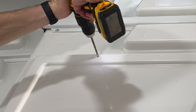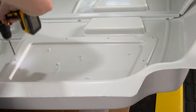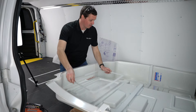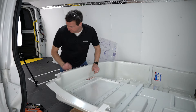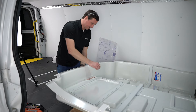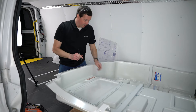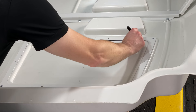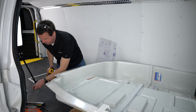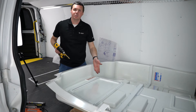We're going to drill all these holes first. Now that I've got all of these holes drilled, I'm going to take one of these steel frames, line it up, and put in four of my screws on the four corners to index this frame — and I'm going to use this as my template. Next, I'm going to take a pen or a marker and trace the inside of this frame. It's essentially going to be my cutting line. And I'm going to change out my quarter-inch drill bit for a half-inch.